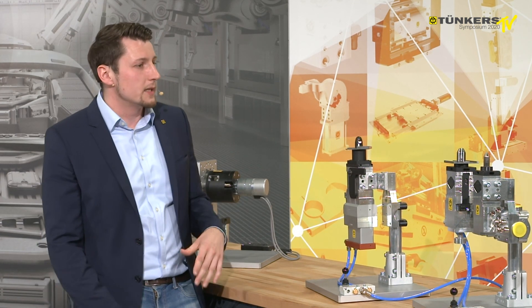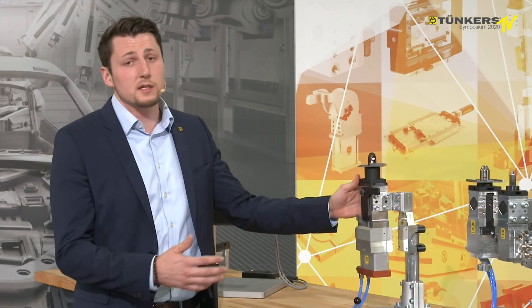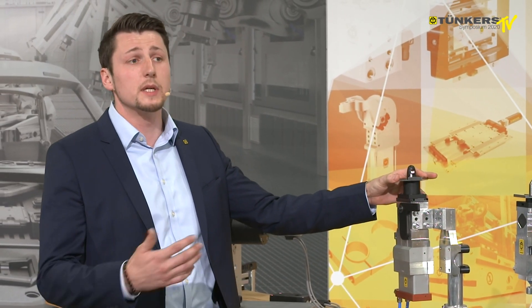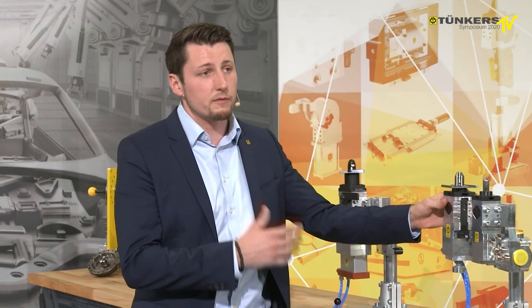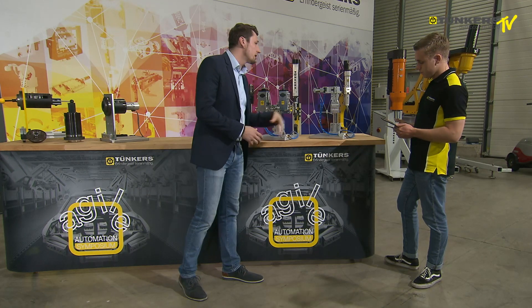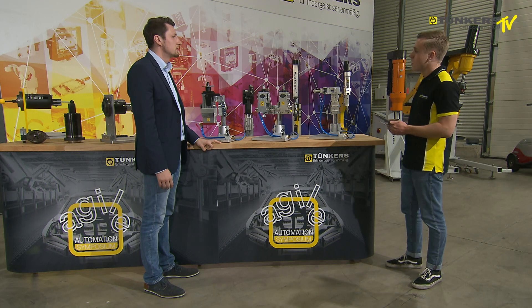What are the differences between the three versions? In the case of the three underbody clamps, apart from the sizes, the function is a very important aspect. In the case of the first model, based on a standard underbody clamp, but here with a 7 mm clamping stroke. In the middle variant, the STZ, we have a fully encapsulated housing and clamping set which provides protection, and we can also compensate for different sheet thicknesses. The other version is deflected by the toggle, resulting in a very compact design. Different features lead to different applications.